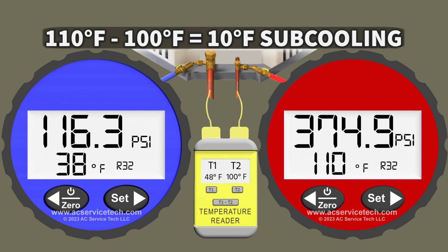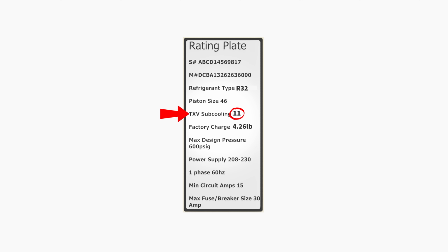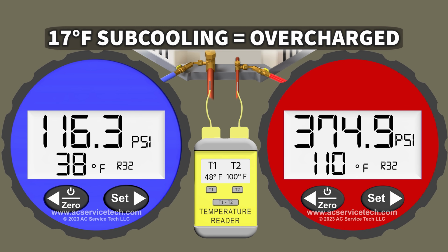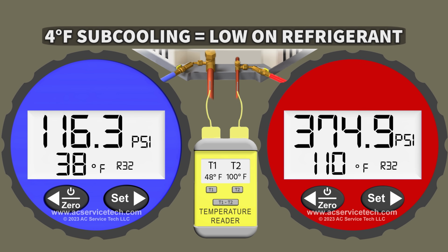If we had maybe, say, 17 degrees of subcooling when the target was 11, that would mean that we're overcharged. And if we had, say, 5 or 4 degrees of subcooling, then that would mean that we're undercharged. We need more refrigerant in order to fill the saturated refrigerant area in that outdoor unit. And if we had 4 or 5 degrees of subcooling, that means we're low on refrigerant, and so we need to add refrigerant in order to increase the amount of area in the outdoor coil that is filled with liquid refrigerant when you have the air crossing it.